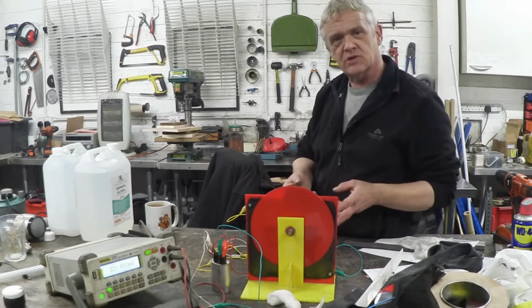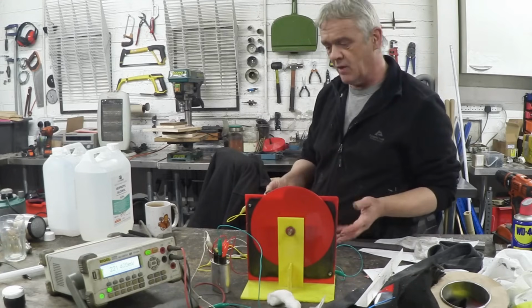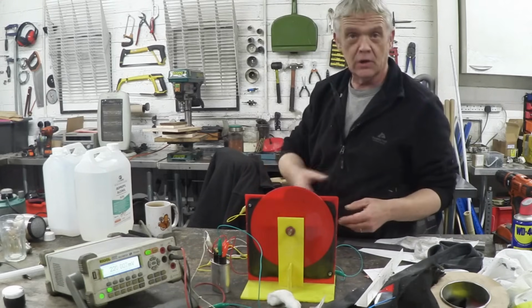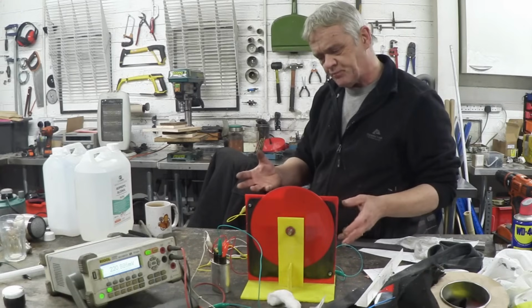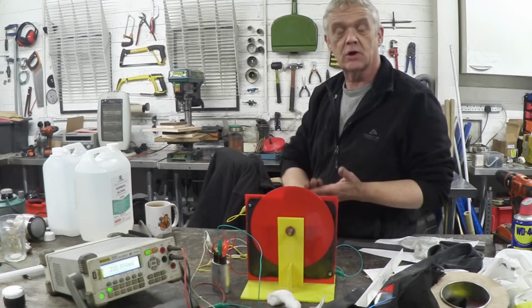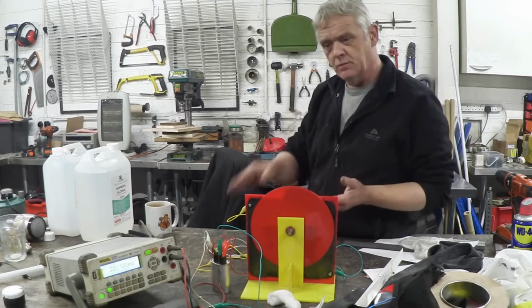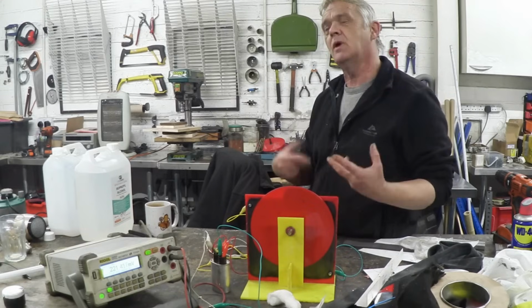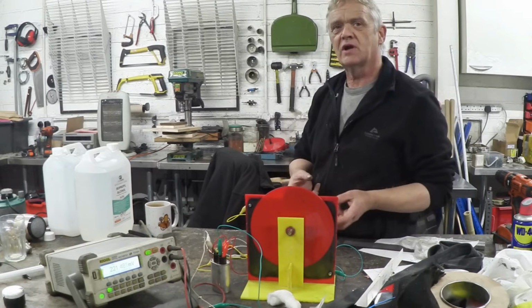And that's where a lot of electrostatic machines actually get their ability from, the power of induction, and alternatively earthing it and not earthing it. So if it was pure induction, then putting some insulation tape over the top wouldn't make a blind bit of difference. But because they put insulation tape across the top and it stopped working, it made me think, well, maybe there's an element of triboelectricity here.